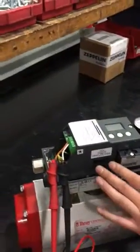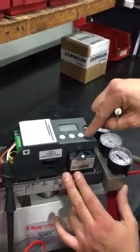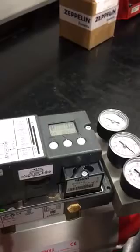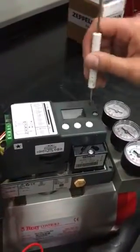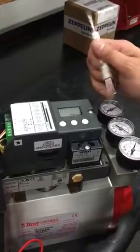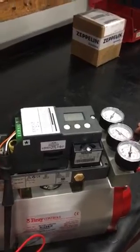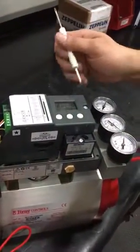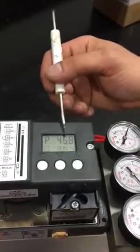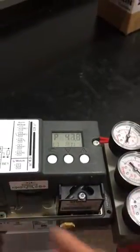Do you adjust the potentiometer until it's correctly calibrated, or do you have to rerun the calibration once you do that? You have to continue the calibration by pressing this same button right here. The correct range for it to read 0 to 90, you want your potentiometer to be between 6.4 to 8.0 when it bugs out. You get a digital range reading right here — like right now it's reading 46, 45 range. This number is going to go up or down depending on which way you turn your potentiometer.